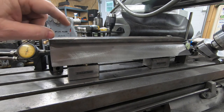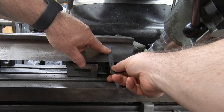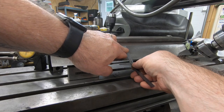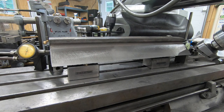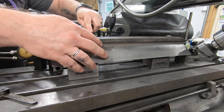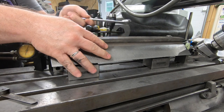After taking some quick measurements here of the length of the prism face as well as the depth of the sole, comparing the left to the right side, it does look like I am taking off more material on the left than I am the right. Remembering that I'm using a couple of 1-2-3 blocks as a backstop behind the straight edge, it's probably not that unusual or unexpected considering it's a rough casting back there. Because I didn't take that into account, I've taken off more on the left than the right, about 115 thousandths of an inch total depth on the prism face. So I'm going to need to make some adjustments.